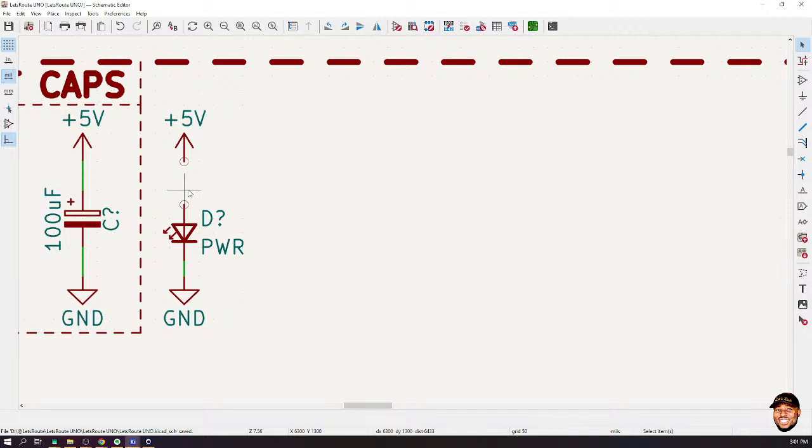Okay. Yeah. A follow-up question on that. So what is the intended voltage supply for your system? It's any DC voltage. The voltage regulator we are using could handle up to 35 volts, but it's not ideal to drive it that high. So any voltage from 7 volts up to 18 volts is okay, even 24 volts is okay.